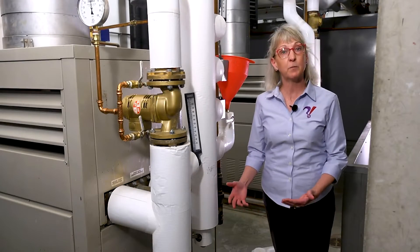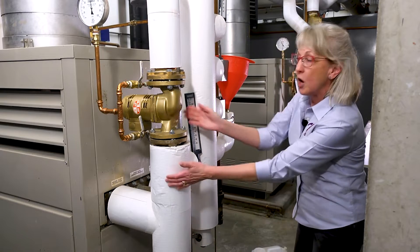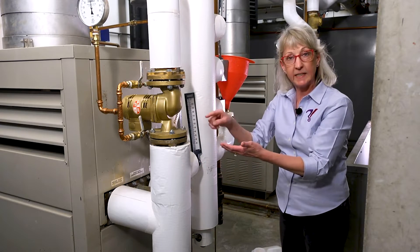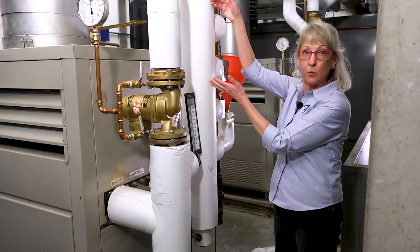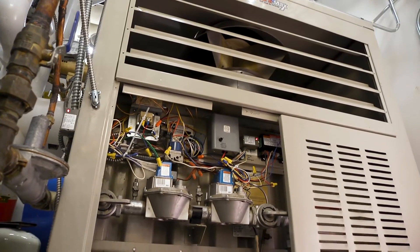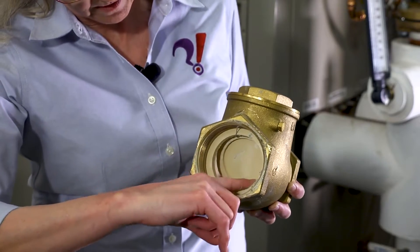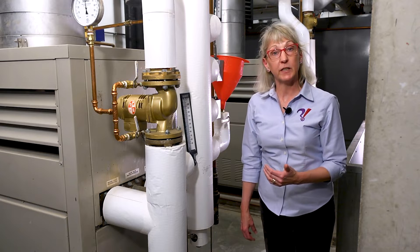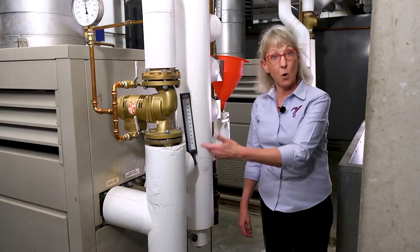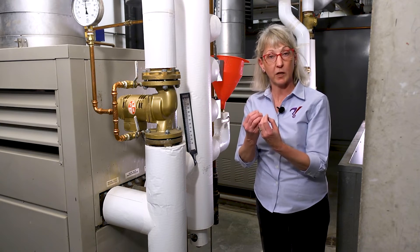You may have a tankless boiler for your domestic hot water system. In that case, hot water enters the boiler through this pipe, goes through a series of small tubes inside the boiler and over the gas-fired flame, and then comes out of the boiler through this pipe hotter than it went in. In the process of heating the water, scale can build up on the inside of the tubes because of the hard water coming into contact with the very high temperature metal tubes. Scale can not only reduce the efficiency of the boilers, but it can also reduce the flow of water through the boilers. And when that happens, you can have some localized boiling of the water molecules and then collapsing back into liquid, a process called kettling.